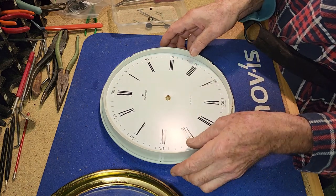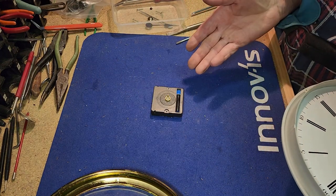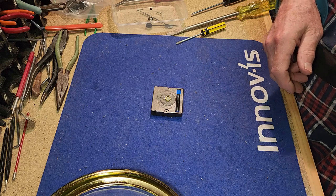I like to use a large flat-bladed screwdriver to get these retaining nuts out. You could use circlip pliers because there are two grooves, but if you've got a good end on a screwdriver and it fits in the slot neatly, they nearly always undo — and this one's very easy. As long as you don't put excessive force, if you have a poor screwdriver you're likely to slip and scratch things. That's all we need to do to take the movement out. Now we shall have a look inside and see if we can work out why it's not running.